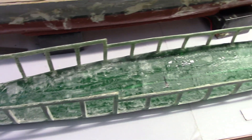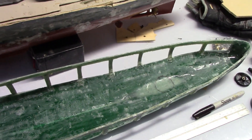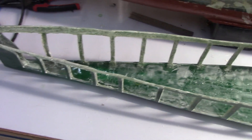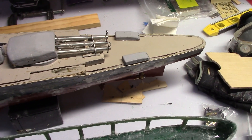At this stage, because it's very early in the build, it'll be a preliminary layout, but it'll give you a notional idea of where components can be. When you finish the boat, it'll be relatively trim fore and aft. Also, determining the layout helps establish where the deck pieces will be installed.